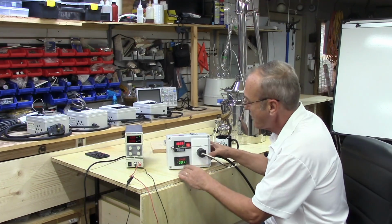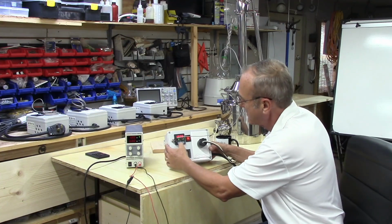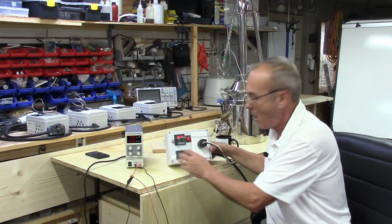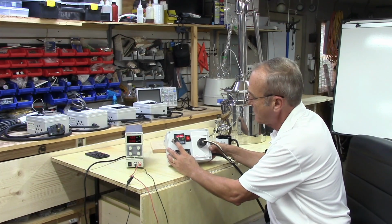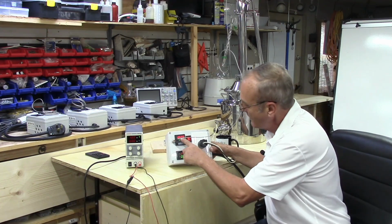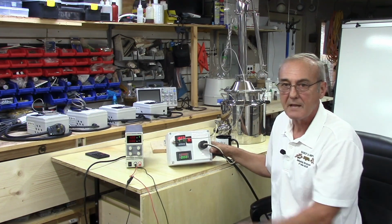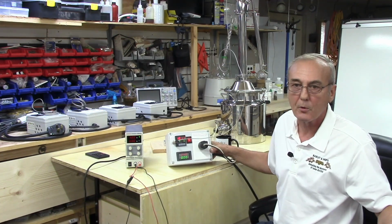So you can see that your PID does that all the time. It's constantly doing that. Okay, to turn the manual run off, all you do is push that button, that is the AT run button, and turn it off. And now you'll notice, since I'm way above my set temperature, it's at 0. That's the output percentage of the PID to the element. That element is totally off.